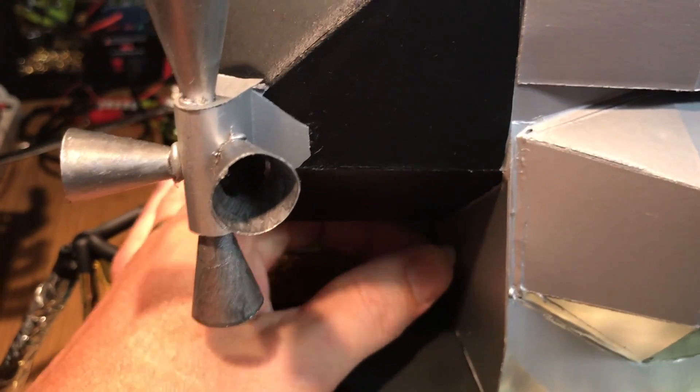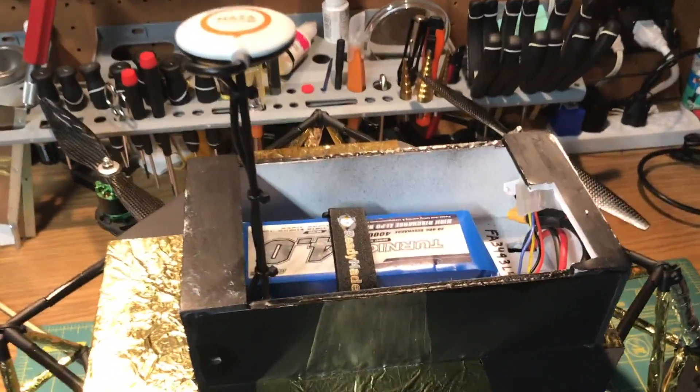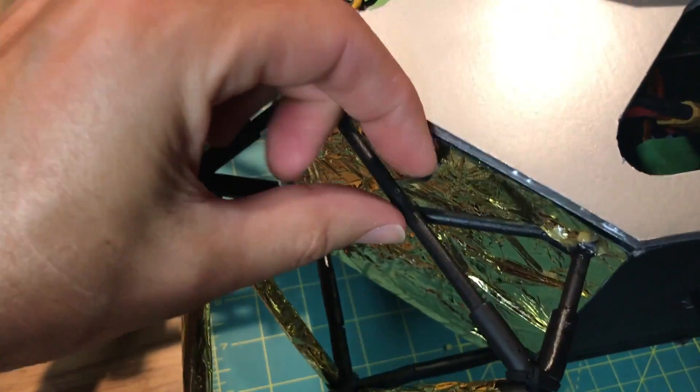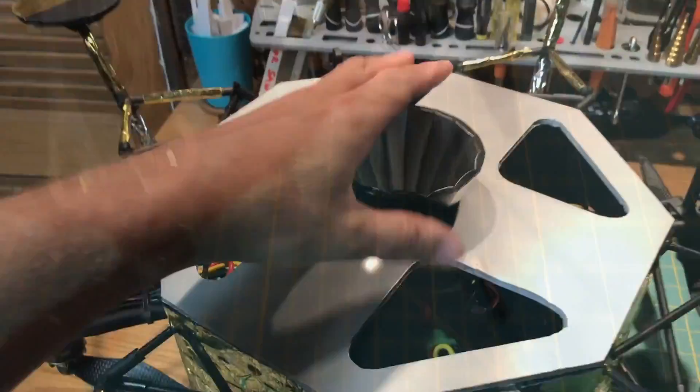The other challenging area was the slits in the side, which partially disguise the props and keep the drone itself at a low profile. I created the model in two parts — the ascent stage and the descent stage — much like the real spacecraft is designed. This also enabled me to have easy access to the electronics and the battery. I didn't originally plan on building the bottom with an exhaust nozzle, but since the model would be flying overhead most of the time, it looked pretty ugly inside, so I took extra time and built out that bottom portion.